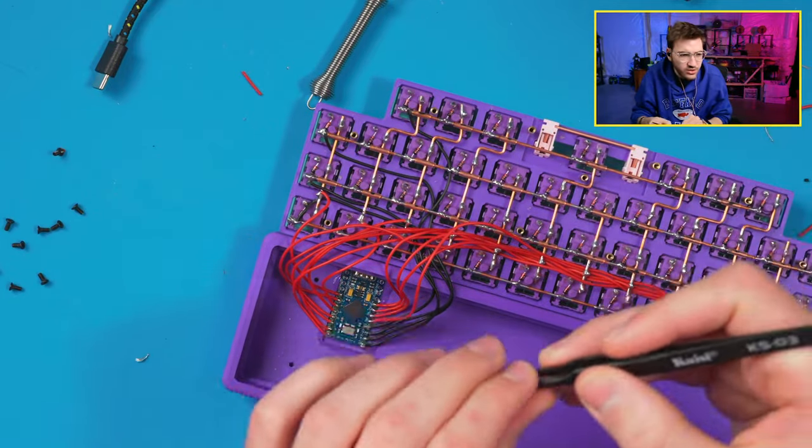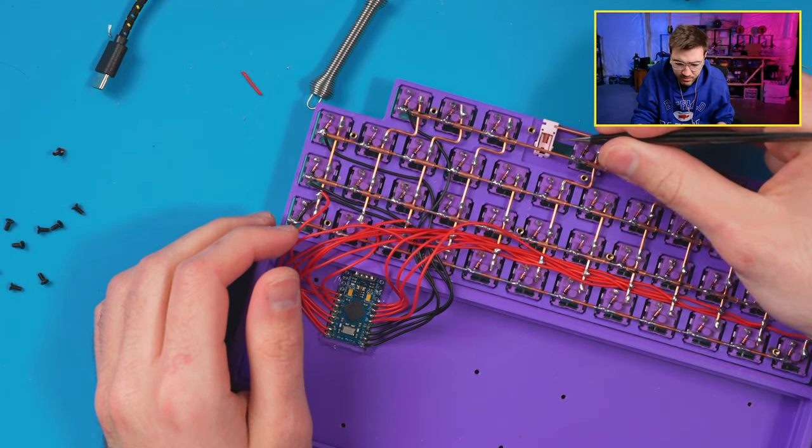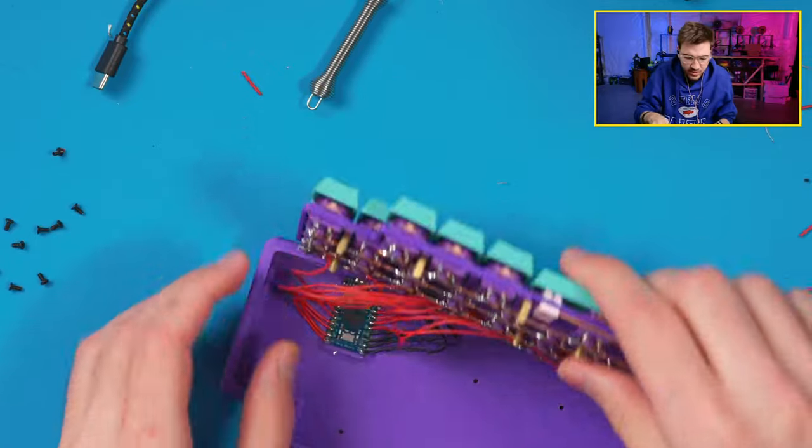I have issues with tolerances with the cross and stems and printing keycaps. Yeah, that's the issue with keycaps whenever you print them, either resin or FDM. It really doesn't matter which way. They're just a pain to print. Because, I mean, we're talking pretty tiny tolerances here.